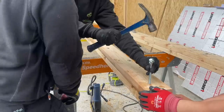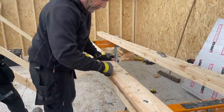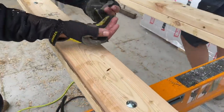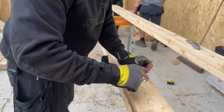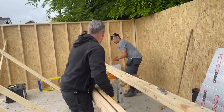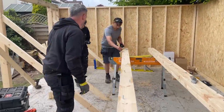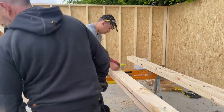Right, so that's bolted now. The reason why the bolts are staggered is because if you put them all down the bottom it will want to open like that, and if you put them all in the middle it's not as effective. It's better if they're staggered - up, down, up, down, up, down. What will happen now is this has become increasingly heavy, so we're going to put a washer and nut on each bolt.